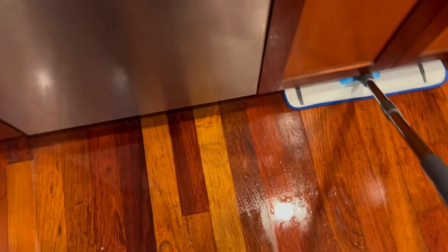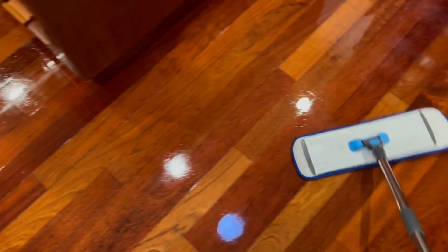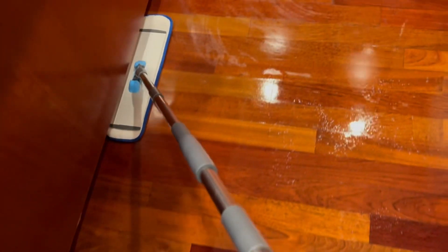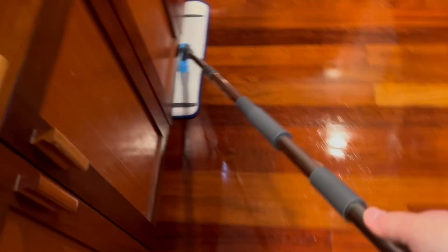Here's the red pad — the maroon or red pad, I call it, a synthetic scrubbing pad. At this point we got all the slurry out, wet mopped it, dry mopped it with the flat mop so we're at a neutral state with no wax buildup. So we're doing a basic clean and buff shine. We'll go over all the edges with a microfiber pad and over the center, just to dry it out a little more. We sprayed a neutral pH cleaner — I highly recommend a Squeaky Clean cleaner. That's what we did here. Spray it down and then go over it with the red pad.